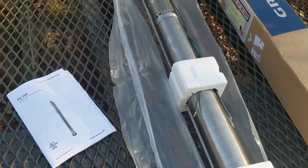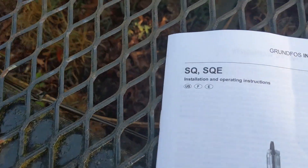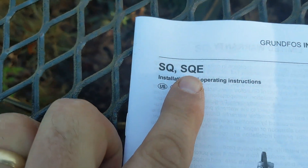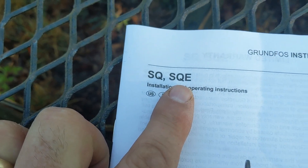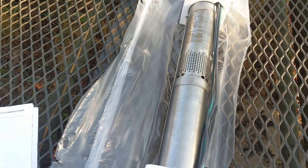These are great pumps for a lot of reasons — the Grundfos SQ. They often get confused with the SQE, which is a constant pressure pump and pretty awesome too, but it has a separate controller and transducers required. With this pump it's simpler in that it doesn't need a controller.